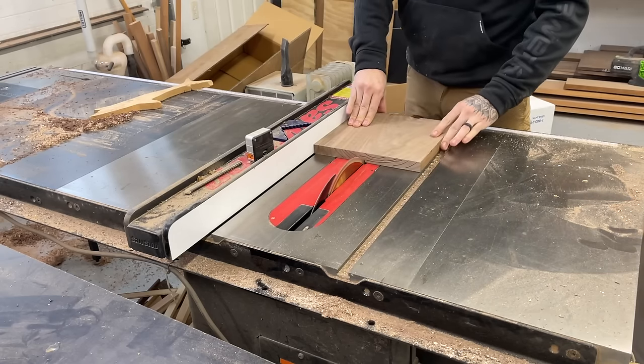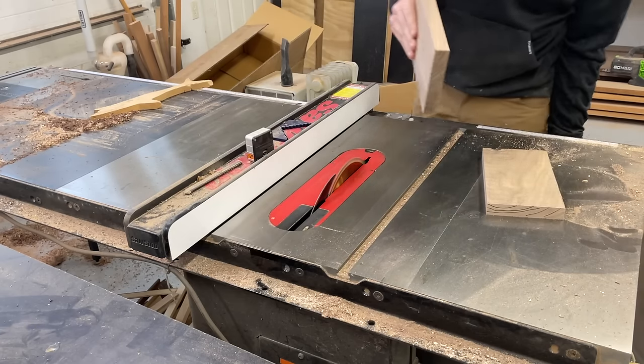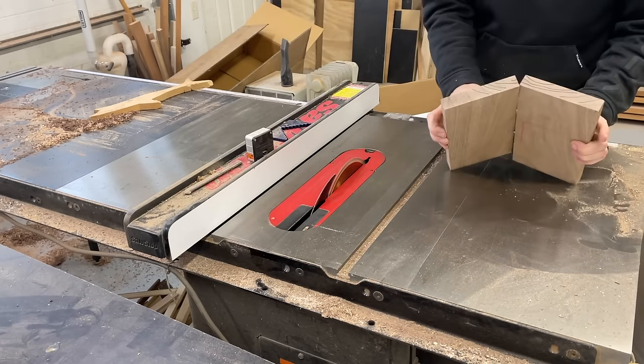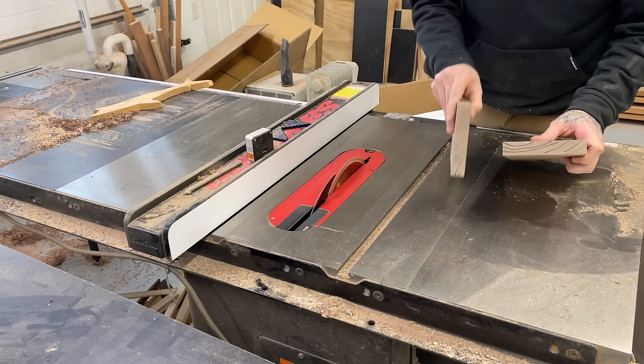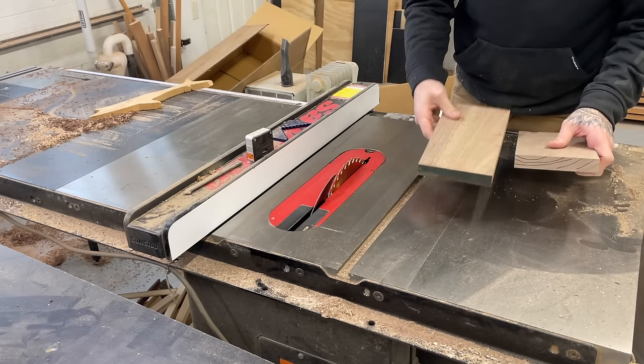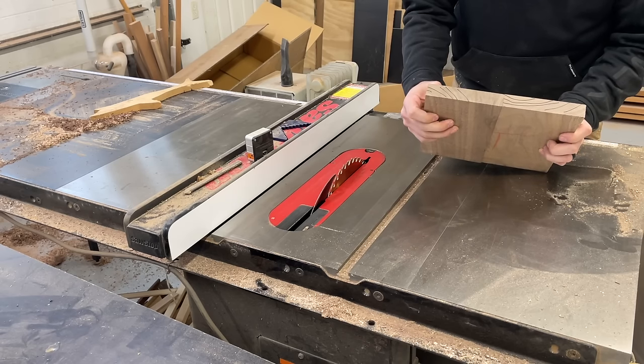Here's a wider chunk of wood — it's just best practice to cut it into two to three chunks. If it's over eight inches, it's just better in multiple pieces. It's gonna be more stable, less likely to warp, and once it's oiled and sanded you're really never gonna know. Just make sure you glue it together in the alternating grain, otherwise it just defeats the purpose.